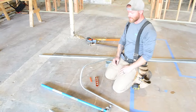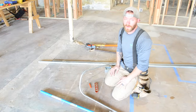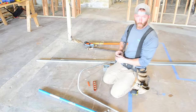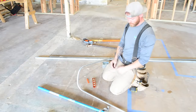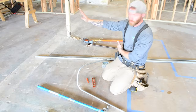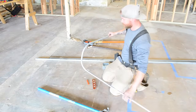You'll bend stuff and then it's an inch too long or an inch too short, or it's 6 inches the wrong way. Just remember, if you're going to take off anything, the takeoff goes away from you and the end of the pipe comes towards you. And that's a forward bend. Back bend is just simple. It's just one mark. Flip the bender around to the back side and you're bending the back towards your back. So that's 1/2 inch with 90s.